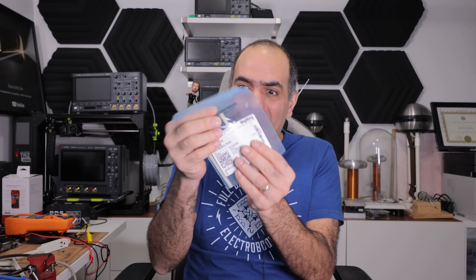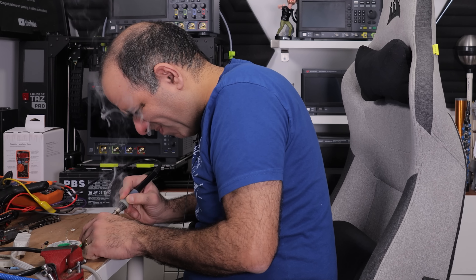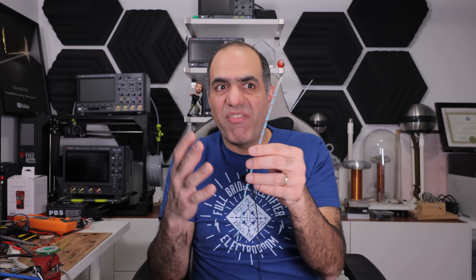Look what I bought — I got 20 resistors each 100 mega-ohms. I've never held so many mega-ohms in my hand, except maybe for an open circuit. Each one of these resistors can handle seven and a half thousand volts. I'm gonna put all 20 in series to get 2 giga-ohms, and that should be able to handle 150,000 volts. Let's start soldering. The only problem is that if I place 150,000 volts across this, the voltage between each resistor is still so high there will be corona discharge everywhere and it affects the voltage reading.